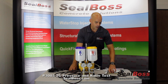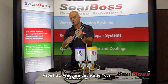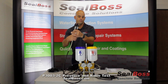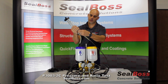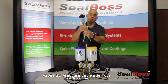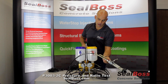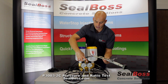After that's done, you're going to want to go ahead and hook up to your applicator. You'll take your A hose, hook it up to the A side, B hose, hook it up to the B side, and you'll start to run your pump with the valves closed on the applicator. We now have a closed system, and you're going to want to go ahead and reach about 5,000 PSI pressure on your gauges.